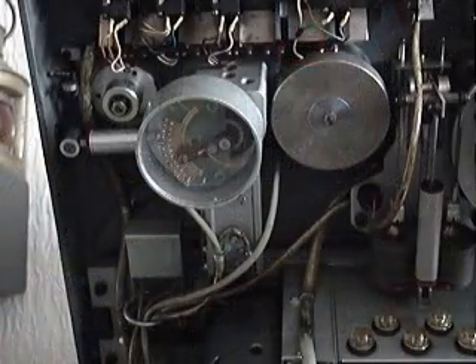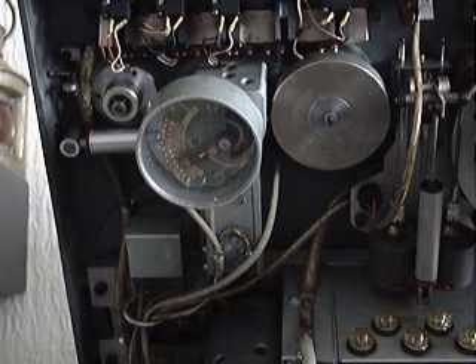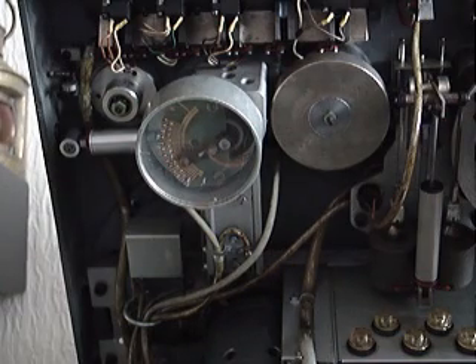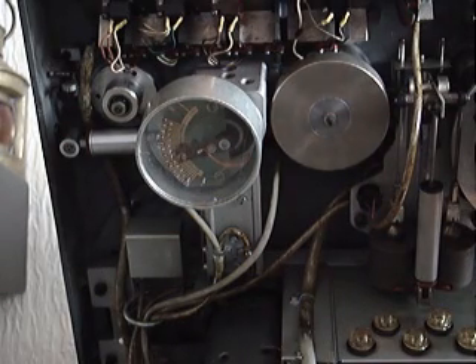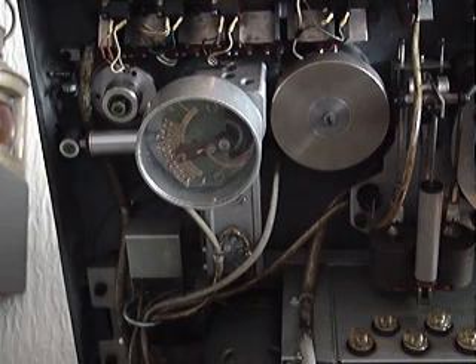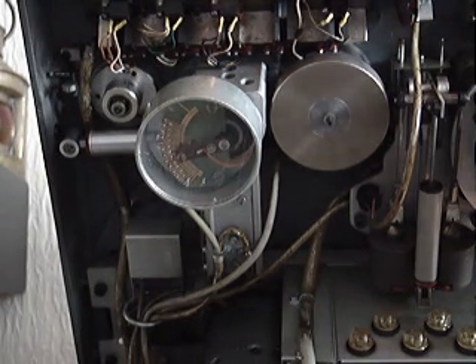The tape recorder has an early style of feedback control. We have a set of rollers on the top of the machine which operate a controller here, which sends back different voltages to the logic. If you press play, it then settles the reel down, giving an adequate amount of back tape tension so that the tension isn't too high when the tape gets to the end. As the left-hand reel empties, if the tension is too high you get lag on the tape and the wow and flutter goes up. The idea behind these electronics is to stop that from happening.